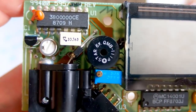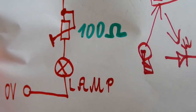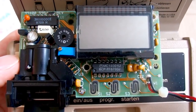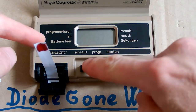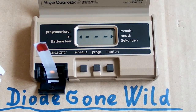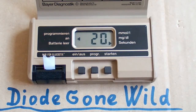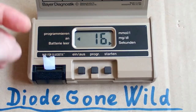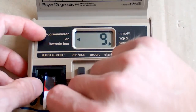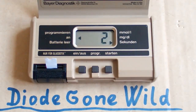Medical devices are powerful, but you should focus on prevention first instead of hoping for medicine and technology to save everything. It's also disappointing that such an important machine can fail because of something as simple as a potentiometer — it's a weak point in this design because it handles the full current of the lamp and must dissipate quite some power. Modern glucometers probably use digital calibration instead of a potentiometer, making them much more reliable. It's an interesting machine, but it's better to live a healthy life, eat well, and stay active so you're less likely to ever need one.